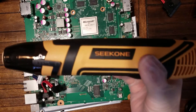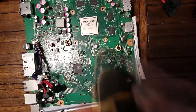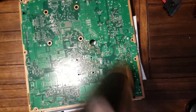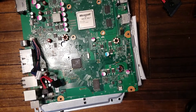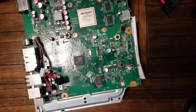This is a cheap heat gun I bought off Amazon — just one setting, gets up to about 700 degrees Fahrenheit. When you're hitting your motherboard with a heat gun, make sure you're constantly moving. You don't want hot air staying on one spot too long, otherwise you risk melting components. My goal here is just to melt the flux down over the resistors and warm up the whole board to reseat anything that might be a little loose. After letting the board and flux cool down, I take a quick iso swab to clean up any leftover flux.